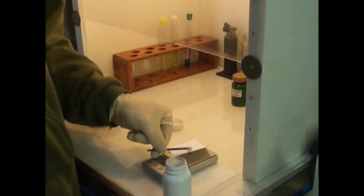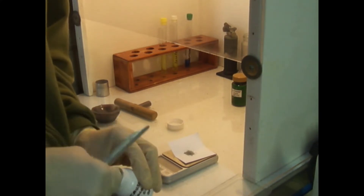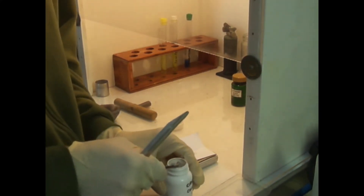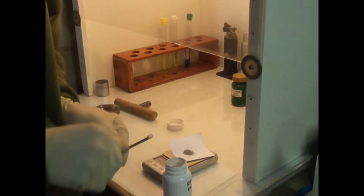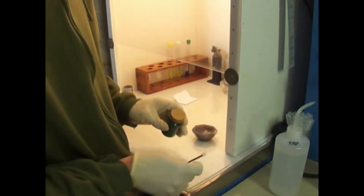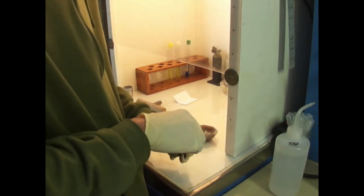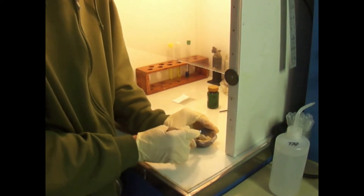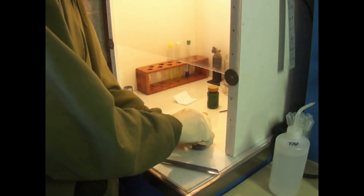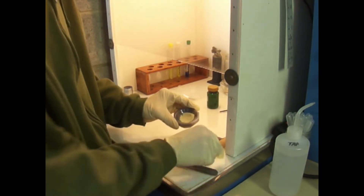I think the volume is a little light — about 0.16 mL. Even though the volume is smaller, the amount of sample is a little higher at about 0.27 grams. I have exactly half a gram of sample total. You need to put in two scoops of flux for every scoop of sample — I have two scoops of sample so I'm putting in four scoops of flux. I'm going to use the fume hood because there is lead in here. I'll mix this up really well and even grind it together.